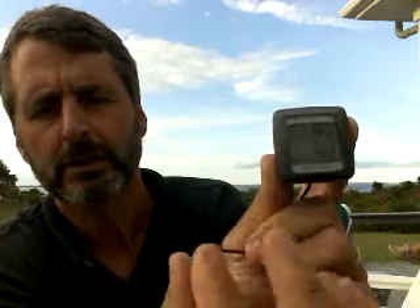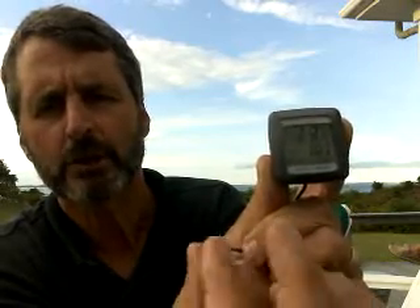If the wind sensor is fine, then check the display. The way to check the display is simple — just take the two bare wires and bend them so that you can tap them together at about once per second. It should produce a reading. That simulates the reed switch opening and closing as the anemometer head turns.